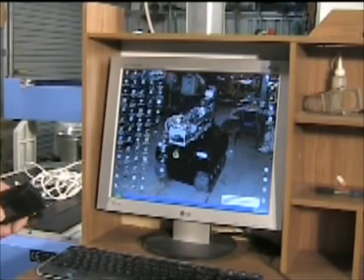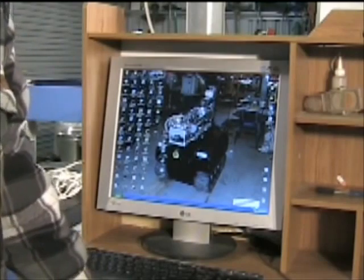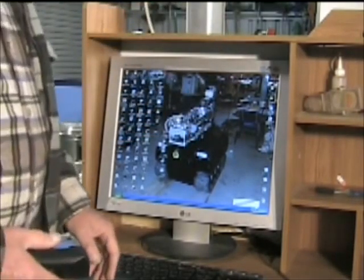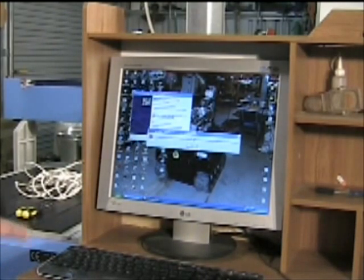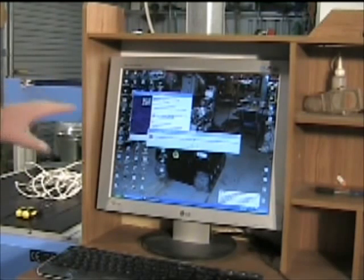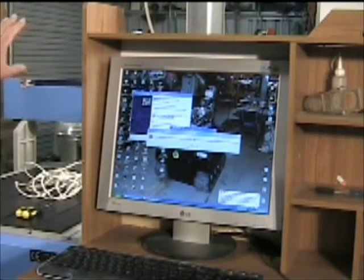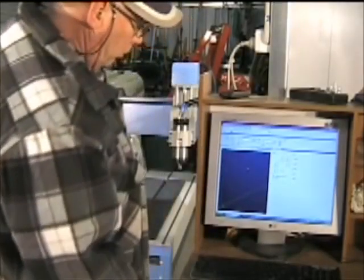It's been installed now and I restarted the computer, having first put the new program in. Windows has found new hardware and is sorting itself out. Whatever you do, do not turn the power on to the CNC machine. The computer must be up and fully functioning, switched on and plugged into the machine with all the drivers installed, prior to switching the CNC machine on.